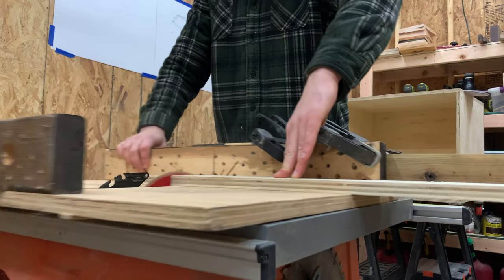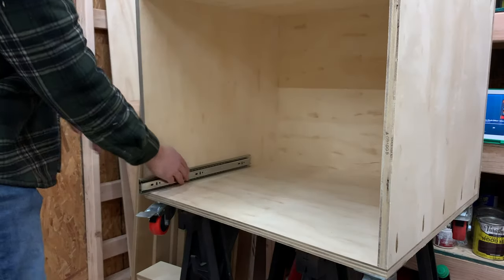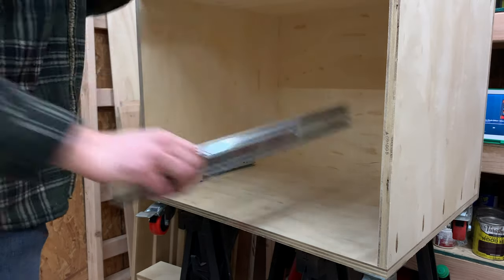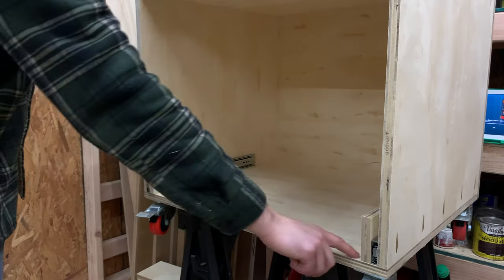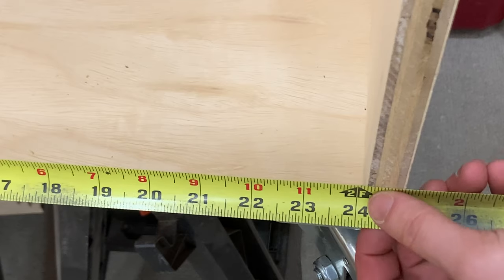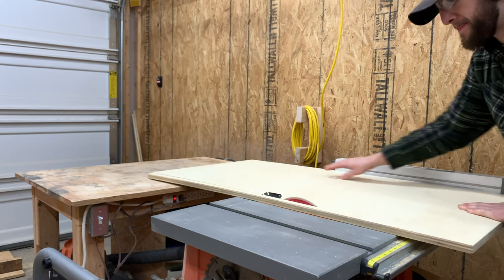One thing to learn with woodworking is that your project will never 100% perfectly match the dimensions in your plans. So figuring out how big to cut the drawer fronts and backs takes an extra step. We first place our drawer slides in the cabinet as well as two scrap pieces that are the same thickness as the sides of our drawers. We then could take a measurement that would be the perfect size for the drawer fronts. The goal was to be at 24 and one quarter inches, but they were actually off by an eighth of an inch — but not a big deal.